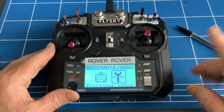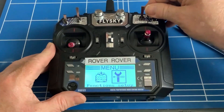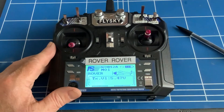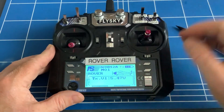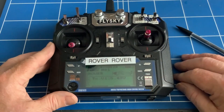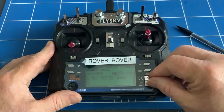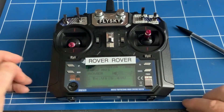There is one very important thing to mention if you're using this FlySky radio. As said earlier, you have to have all the switches up when you switch it on — if you don't, you get the error message 'place all switches in the up position'. Once they're up, before you switch on the receiver you must put the three-way switch into the central position, otherwise it's in the payout position and when you switch on the mark you'll get a strange noise and an error message from the channel with the winch ESC. So switch the transmitter on, then push that switch back to neutral before switching the mark on, and everything should work. Enjoy your radio controlled mark.